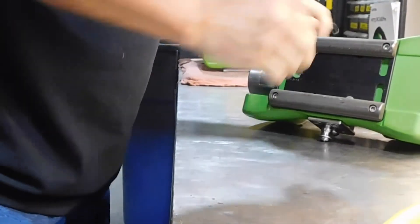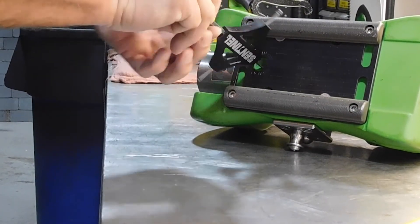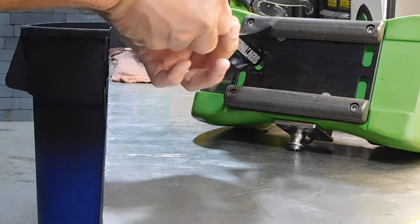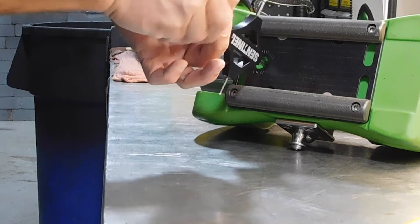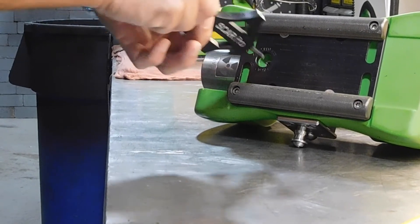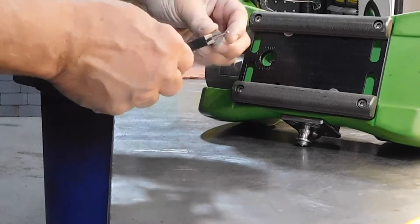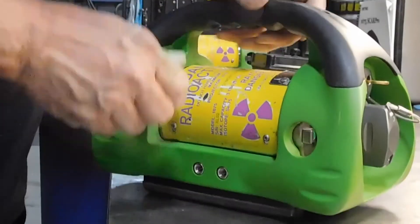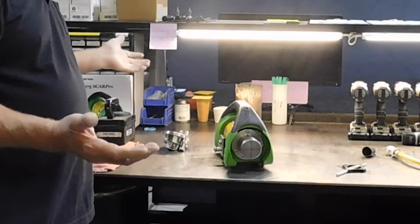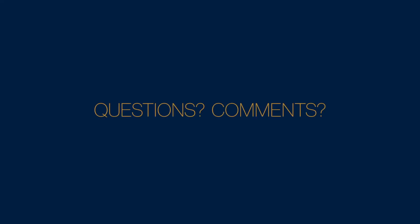Next, take the camera and rotate it over. Then open the internal tungsten shield — twirl it until you feel friction and remove the Allen wrench. The next thing to do is place the flat-head cap screw dust cover back on. Rotate the camera back over. Now you're ready to make the SCAR contact shots, and that's all there is to it.